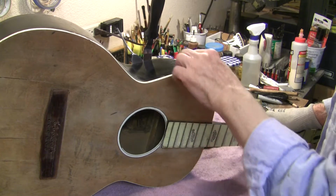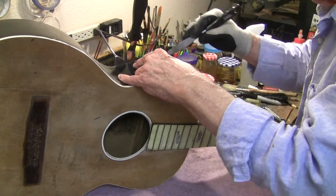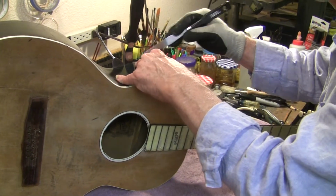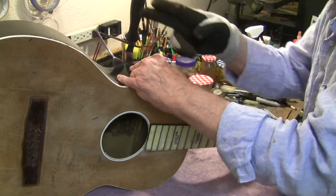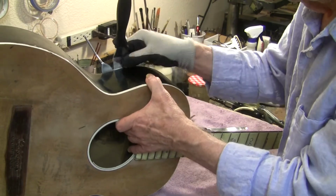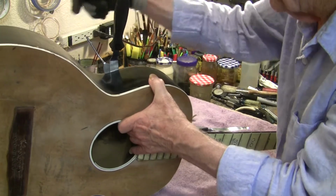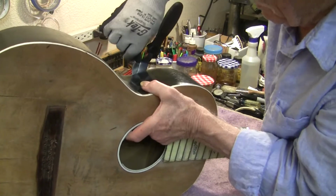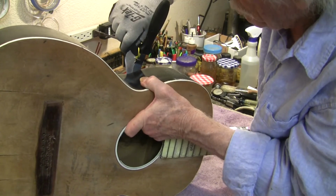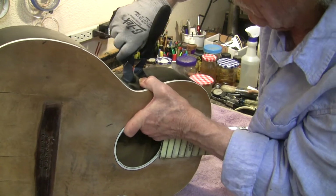Well, I made an inroad here. If I try to move this way, the grain of this sidewood keeps driving these into the side. I have to go in that direction. This one is spreading thick. I'll use it to preload the crack. When it's working, you'll hear a special crack. Hear it? It's the hide glue letting loose.